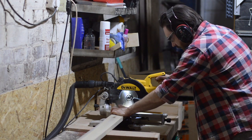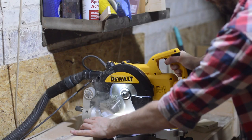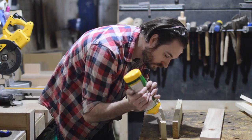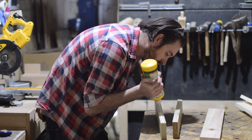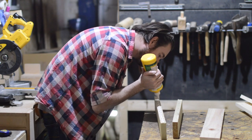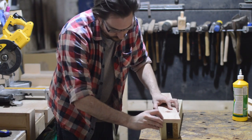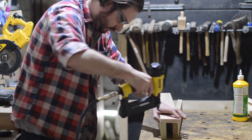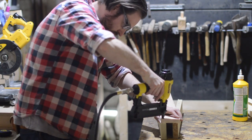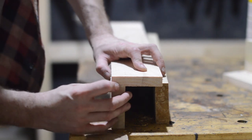These are going to be the legs for the table, so after planing them down I cut them all to the same length and then I can start joining them together. My plan was to join two together in an L shape. At first I thought I'd laminate a few together and make square legs, but I didn't have enough material for that, so I thought an L shape will probably give the maximum support from the material I've got. So they get glued together and then a few brad nails shot in to hold it all in place while the glue dries.